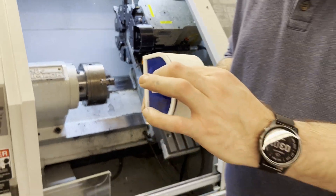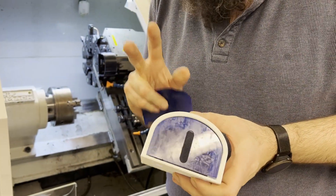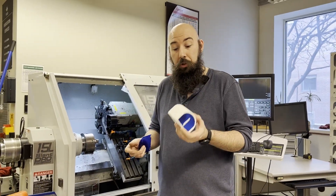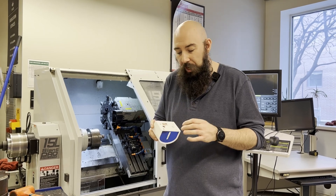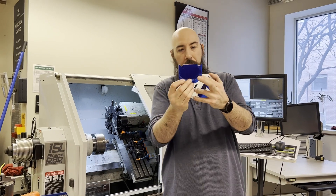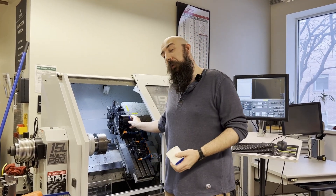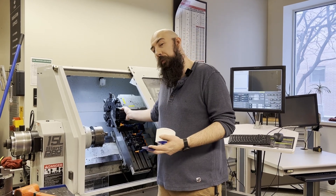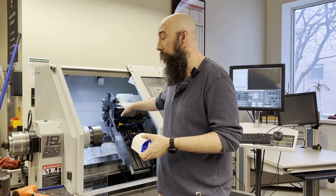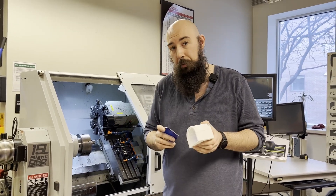On V2, I made the walls a little thicker and I also did it out of a different 3D printing material — this is nylon 12 on our SLS printer, which the coolant should not attack, so this one should last a lot longer. I also updated some of the hole positioning and stretched it just a little bit. One of the windows I had to modify slightly so that it would sit back and be fully closed because of the bolts I was using at the time. But in general, this is fantastic. This one failed in the middle, I printed this one, continued on, and I'm very, very happy with this design.